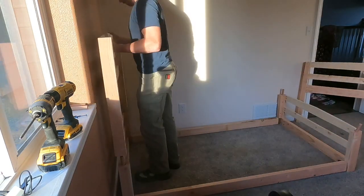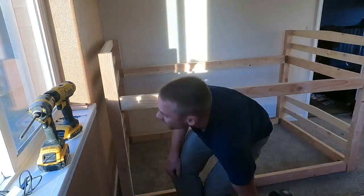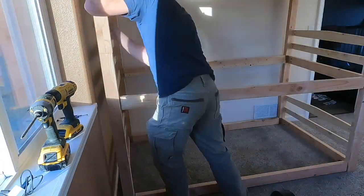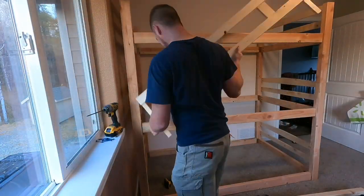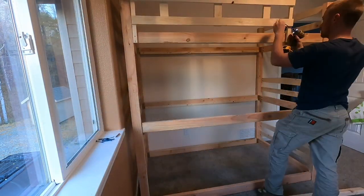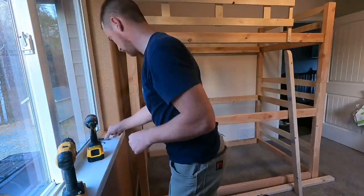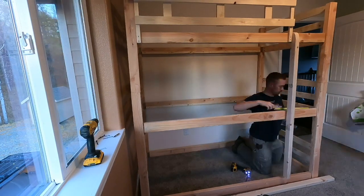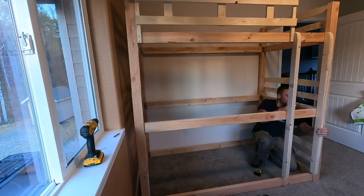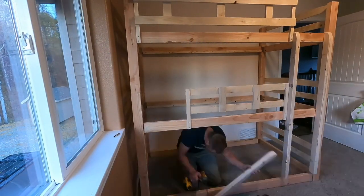This is the first one — that 15.5-inch headboard and footboard — and then the second part. All three can be individual beds, but right now I'm putting it together. You can see where those dowel rods help stabilize and hold everything together, and it really worked out well. Here's the bed rail system. There are only a couple of visible screws, but I kind of like the look. I put one on the side to help stabilize it and it turned out really strong. For the stairs, I changed my mind on how to do those — I attached them because it helped stabilize the bed, but I'll show at the end of the video how I redid the stairs.